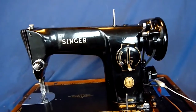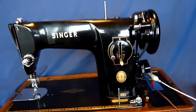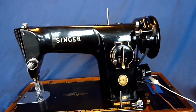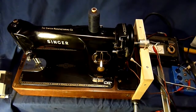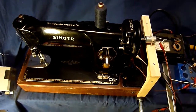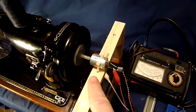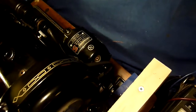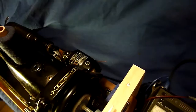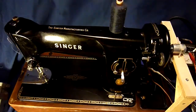I have tried to measure the speed of the machine with different kinds of belts — you should see the results now. This is my Singer 201 running at max speed with no load on it. Using this tachometer, I measure the speed of the hand wheel, and you can see the belt on the motor there. The speed here is just below 800 stitches per minute.